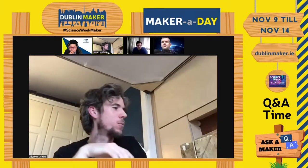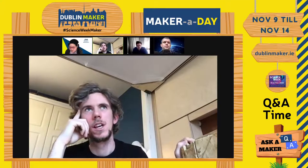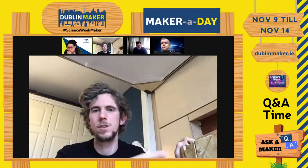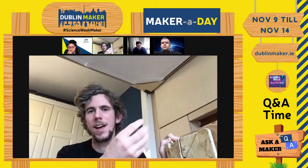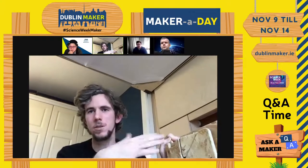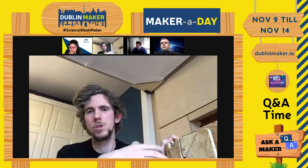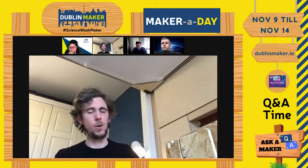So with this, dust and everything like that wears away over time. And I suppose what you can do is you can use the likes of rubbing alcohol or something like that. And actually, when you apply alcohol to wood, like untextured wood like this, it will make the grain expand. And it's actually much easier to get rid of all textures and things like that when you do that. Then you wait for the alcohol to evaporate before you apply any finishes. For this, I've actually left it unfinished. But generally speaking, with the likes of OSB, people would use a polyurethane, wipe-on-wipe-off polyurethane, or actually something thicker, to get a really clean finish over the top. Because obviously OSB is really kind of messy.